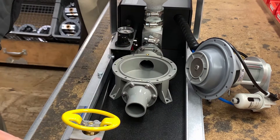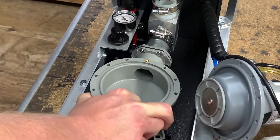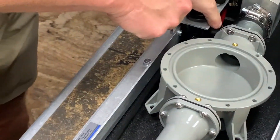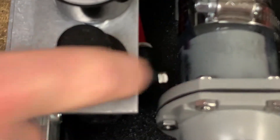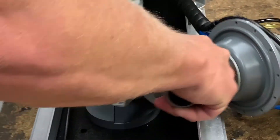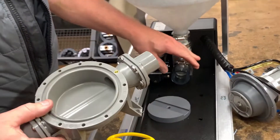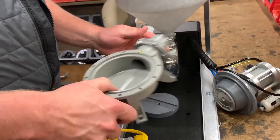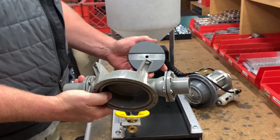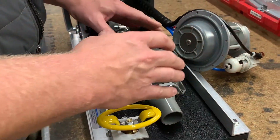To change your flapper valves, the cap screws are already out. You want to be gentle and wiggle the pump body out — you can go up and down as well. The reason I say that is because you have a really tight spot where the regulator almost touches the pump body, so you've got to be careful and just wiggle it out. On this plastic body you always have the puck — make sure that puck goes back when you're reassembling.